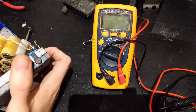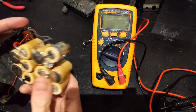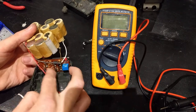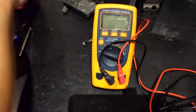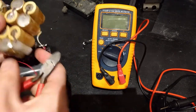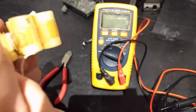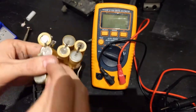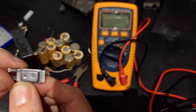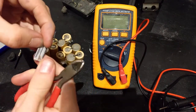A little more digging turns up more information. There are these little wires here attached to a couple of cells in the pack. My first thought is similar to the individual cell connections on lithium packs — that could mean this is some kind of protection circuit to stop the battery getting discharged too low, which would have been pretty important back in the day when these batteries would have been horrendously expensive. We've got another thing welded in series with the pack. Is that some kind of fuse? Don't even know what it is. Wow, I am learning — I thought honestly this would be a boring teardown.